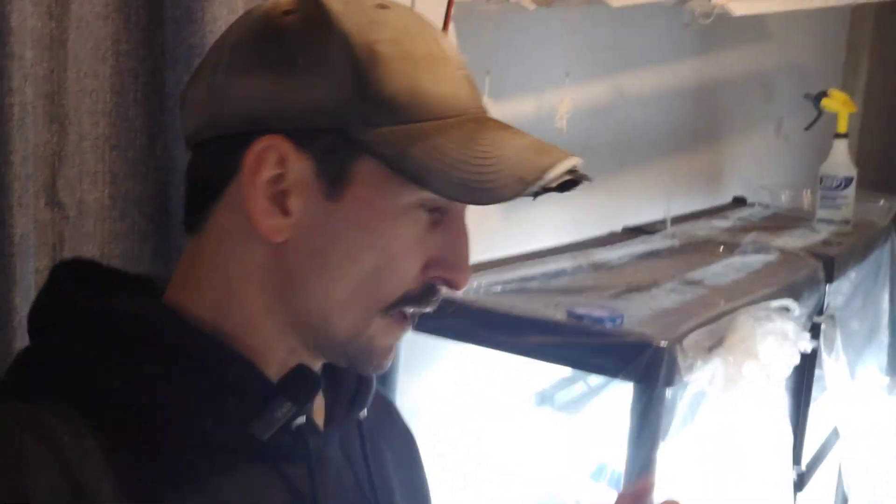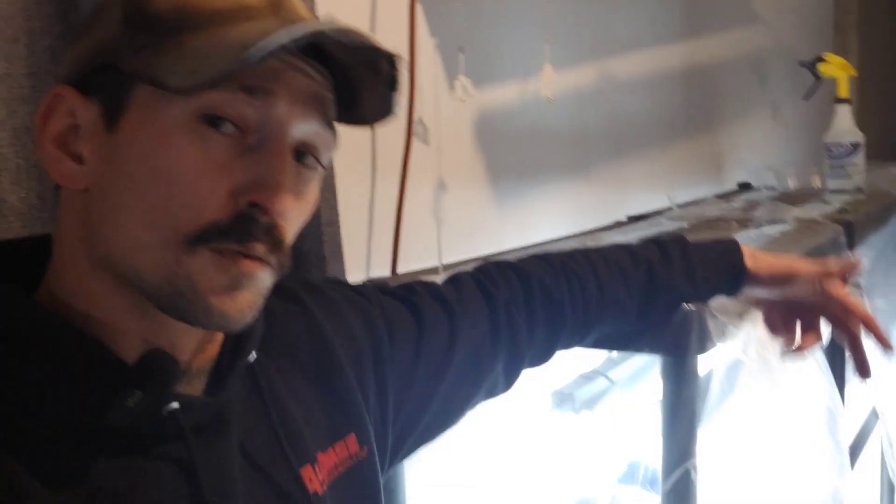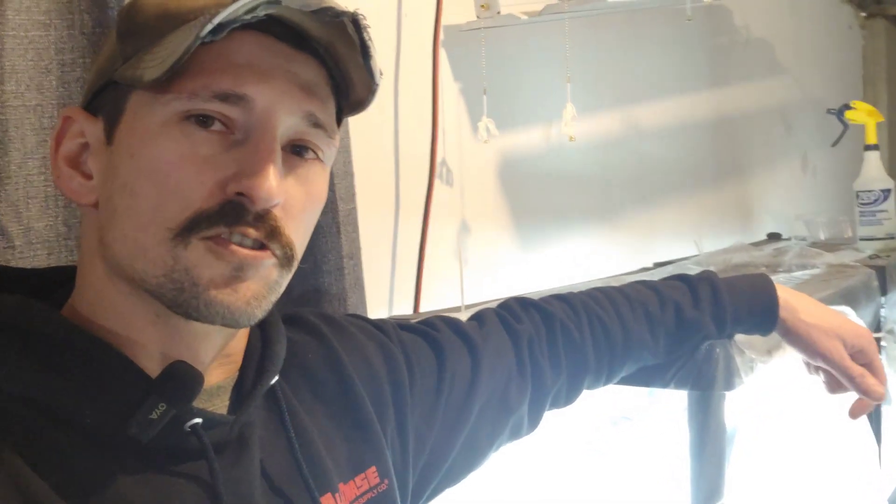Know how much energy you are drawing with your lights — I'll link a video to help you calculate that. When you see people talking about 10,000-watt specialty grow lights without doing a special installation with bigger wires by a qualified electrician, you are just a house fire waiting to happen. Before you start your plans this season: get some shoes with solid rubber soles, get GFCI protection, use grow lights with ground plugs, and don't overload your circuit. If it trips, it's telling you something's wrong. Grow some food without getting hurt — thanks for watching.